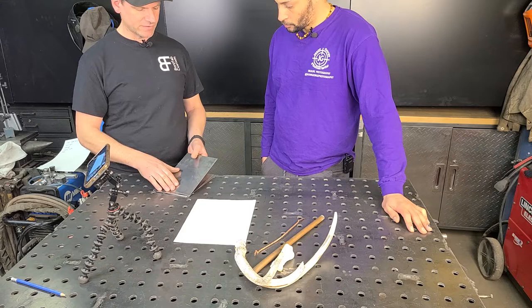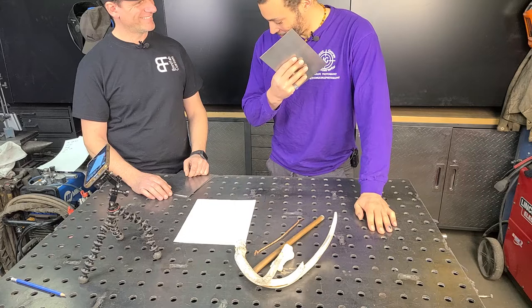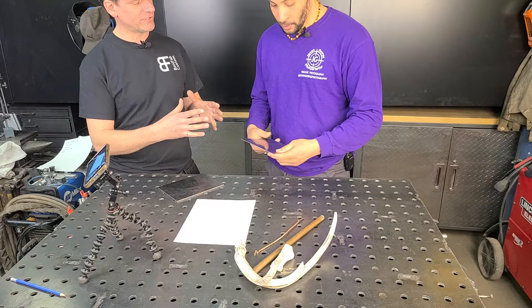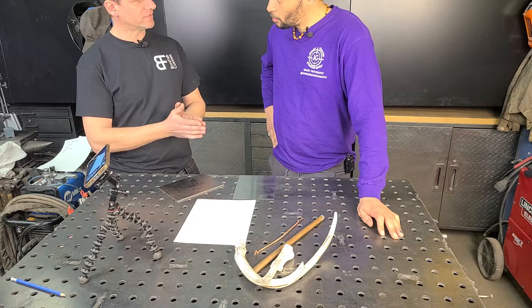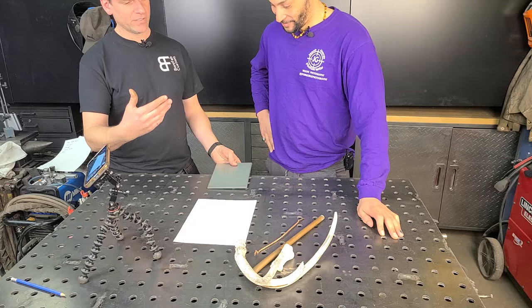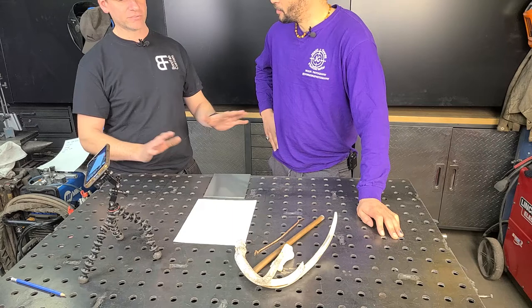This material is called 15N20 — it's a high-nickel content steel, and this will be the actual cutting edge. What we're going to do is make a Damascus blade, which basically means we're going to incorporate different types of metal and forge weld them together. We'll use this new steel as our main structure and everything else on the outside, so it's going to look really cool. I always like to reuse things — if we can reuse the metal and some of the bones and stuff like that, it's going to be next level.